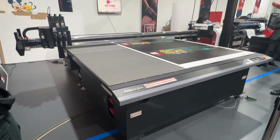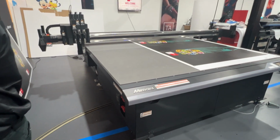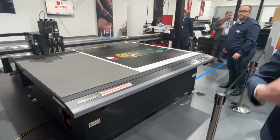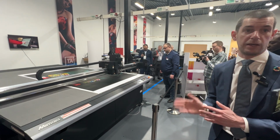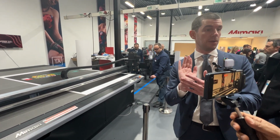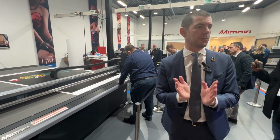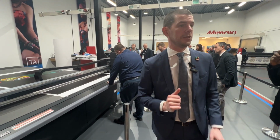The tools you see on the head right now, it's a modular system, so we are able to make a different combination of tools, different pressures, reciprocal cutters, tangential cutters, creasing functions, including V-cut, and we also support a variable angle V-cut function, which means you can not only make 90 degrees corners, but you can also get different angles of corners in your finished product.